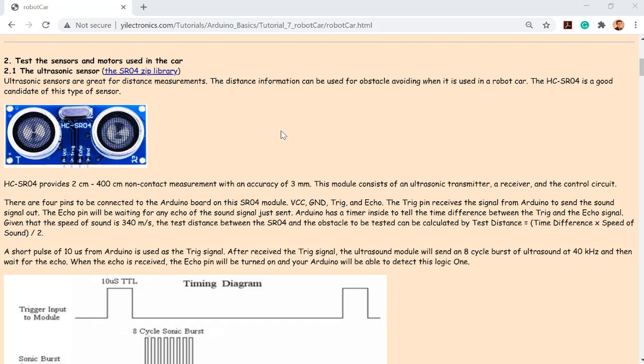The first task is programming an ultrasonic sensor. One side is a transmitter and the other is a receiver. The speed of sound is 340 meters per second. It sends a sound signal to the front, and if there's an obstacle, the signal reflects back to the receiver. Because your digital system has timers, it can calculate quickly: start timing when the signal is sent, stop when the echo is received. Then use the speed of sound to calculate the distance between the sensor and the obstacle.